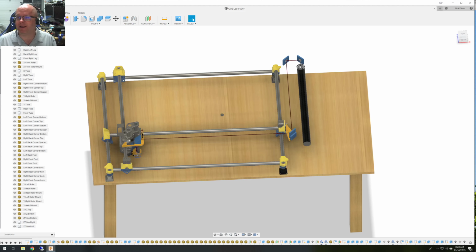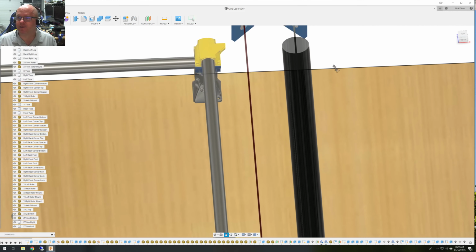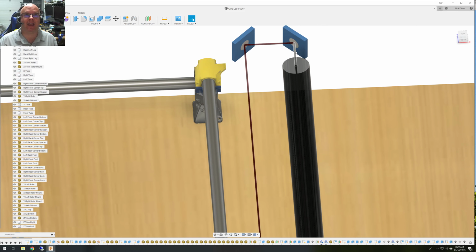I didn't have that room, so I did a modification and added a mirror zero. So what you see here is a mirror zero. And I mocked up the tube by measuring the outside diameter and just made a tube of it with a 3 millimeter beam coming out because that's what the specs call for. So this is a 3 millimeter tube textured in translucent red to emulate a laser beam, but it works for my purposes. So I have a mirror zero, and in reality, this mirror zero is a little more complicated than just a plain mirror. It does have a little LED diode that sits here and follows the beam.